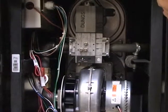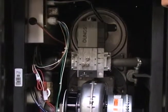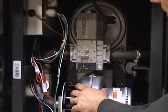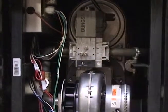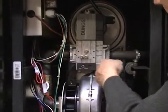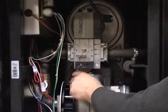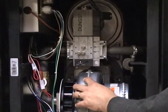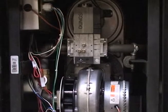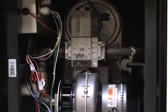This is the combustion system you will have in a VWH. We use the Dungs MBC 1000 valve — all your adjustments are right up front. To service this valve you can simply unscrew these blocks, shut the gas coming in — there's a shut off in the back — and slide it out and unplug it. Your 110-volt supply comes off the relay from our electronics. Your spark ignition comes from here — the spark igniter is connected to the spark electrode where it ignites the fuel. We bring gas and air through the system into the inlet, create a vacuum with the blower, and mix air and gas at a 1-to-1 ratio. That mixture goes into the blower, into the head of the burner, and ignites the fuel to create very clean combustion.